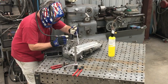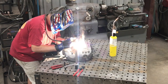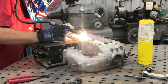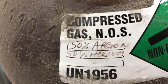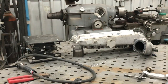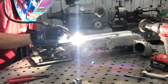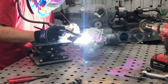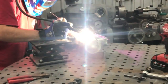I thought I'd bring you this video of welding this one. The first one I did came back because it got some cracks in the weld. This time I ran it a lot hotter and I've got the helium mix in there to burn it in even hotter than that. The main mistake was that the mating surface on the lower intake was not lapped or milled. This customer has a mill, so when he gets it back he's going to mill that surface. The other one that came back — I lapped it in on the table saw and I have a video on that.